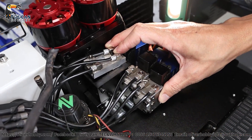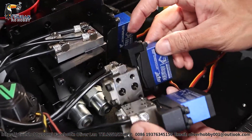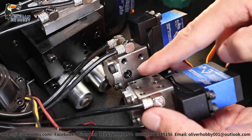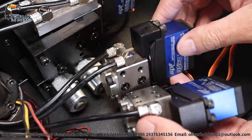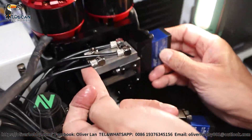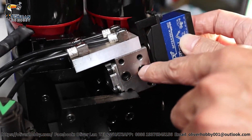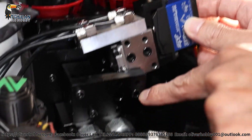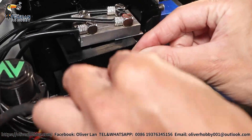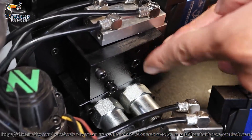All the valve blocks are now removed. Between the valve blocks, in between the two channels — in and out, the main channel — there are oil seals. When you are assembling, please check they are in position. This is the oil seal to the middle black connection part. I will push inside this middle connection part — there are two oil seals in between.